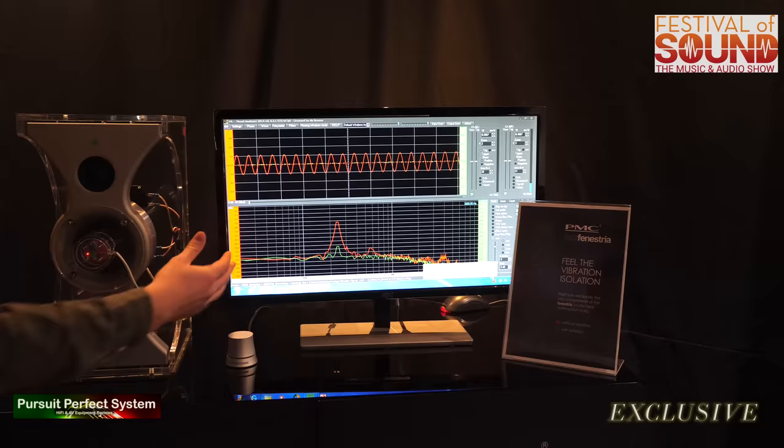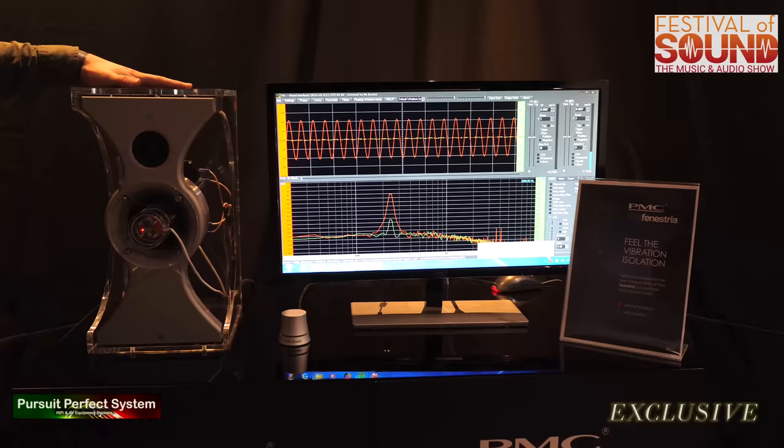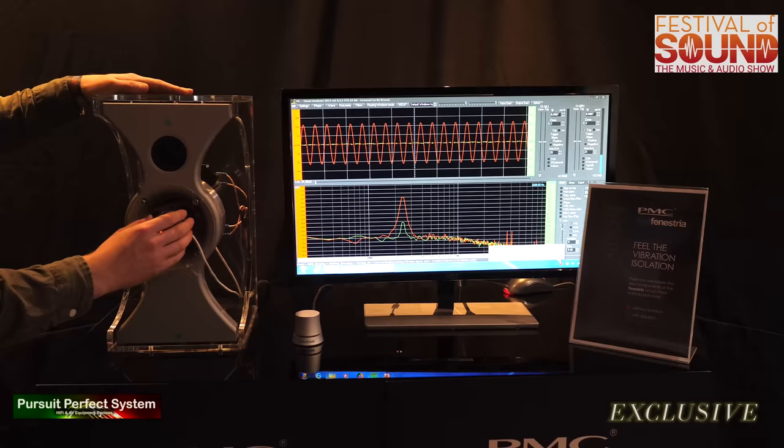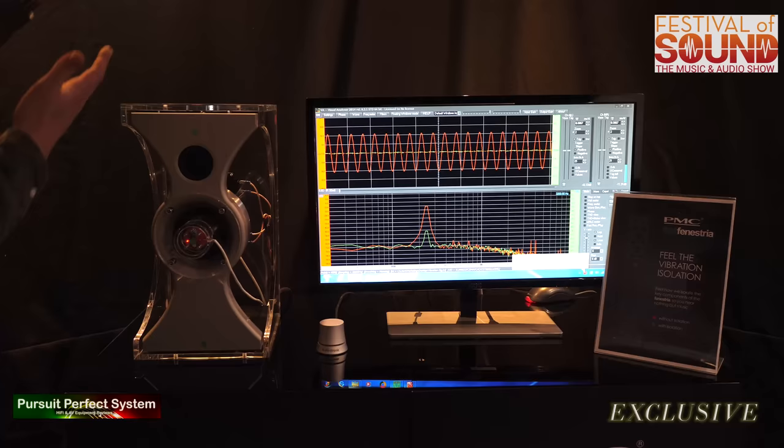You can see here we've got a very strong trace of that vibration on the back of the cabinet and all the way through this enclosure. You can feel there's a very strong vibration coming through this. And on the front, the green trace, there's just absolutely no trace of that vibration. If you feel here and then feel here, it's absolutely eliminated the vibration. So it's completely isolating the two sections of the cabinet — the mid-range from the woofer cabinets.